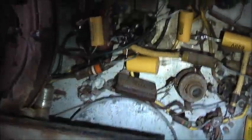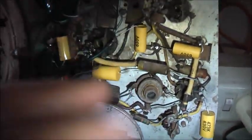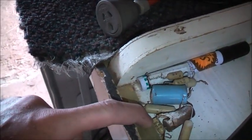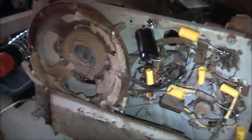It's a fairly compact and tightly packed chassis to work on. I haven't bothered checking resistors yet - they should be within their 10% tolerance. You can get 10% on your capacitors too. I didn't have any .10s, so I put .15s in their place. You can get away with a 5% or 10% tolerance - it shouldn't be too much of a problem.